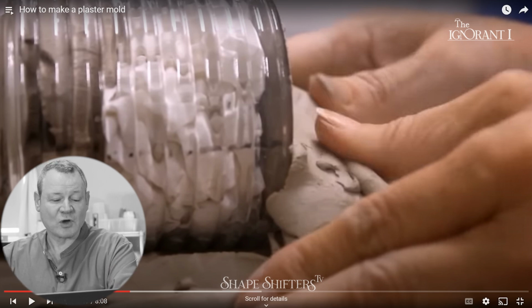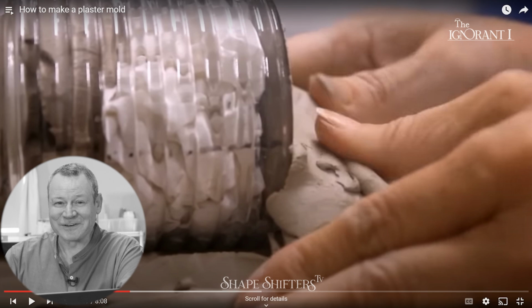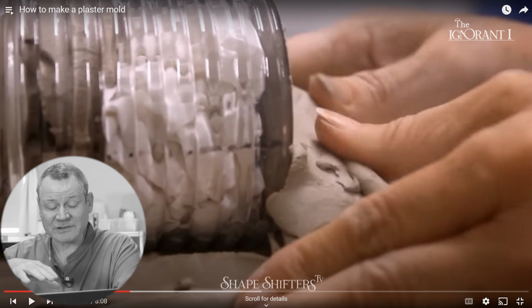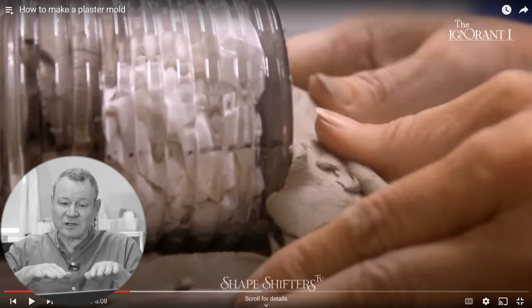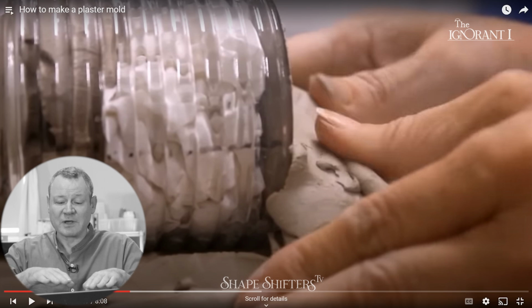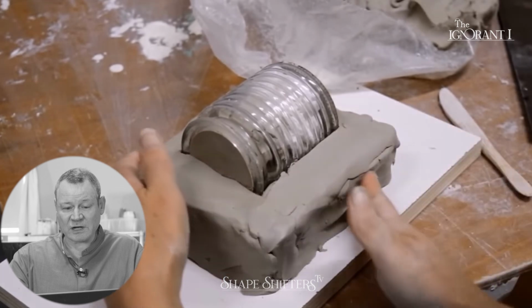I'm gonna stop just for a minute. So I'm crashing down on a few things here because there's some practices that she's doing that will work. My intention is to kind of say, hey, don't touch that, it's hot. You know, if you don't know what not to do, it's sometimes, this looks like a why not do it. And the reason I stopped right here in the video is what I notice about a lot of beginning mold makers is when they're claying up around the model, they'll overwork the clay like it's a sculpture. It's the top layer that you need to care about, not so much the bottom layer. And a lot of people spend time on this bottom layer, and it's a nothing layer. It all gets covered.